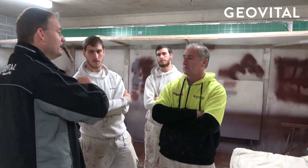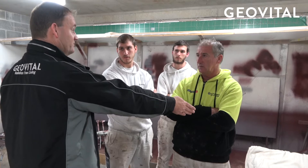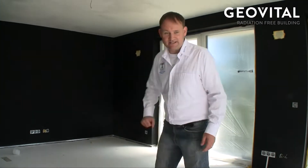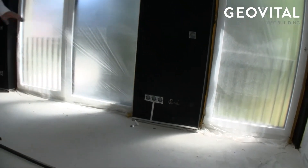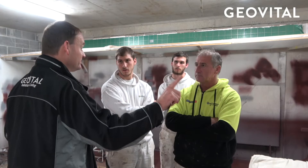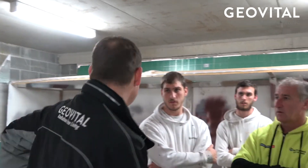The tape goes around the room. If there was a window that goes all the way to the floor, you might have to stop the tape where that window is, then carry on on the other side and get the electrician to connect that tape to another power point. If the tape can continue uninterrupted, you only need to ground it at one point, which is preferable if possible. Place the ground connection somewhere less obvious — that corner behind you when you enter a room would be perfect.